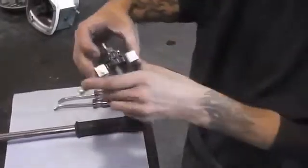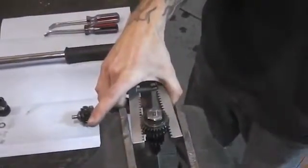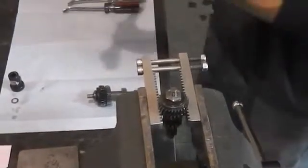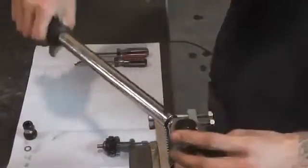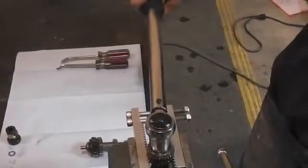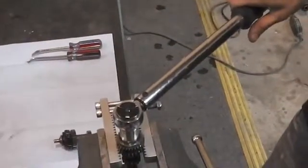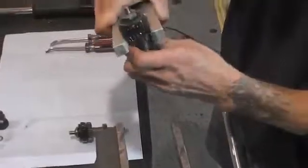We're going to put the clutch right here in this clamp on the second gear down, to make sure you don't hit the other gear on top. Put this in your vise and firmly tighten so it doesn't slip when you're tightening your clutch. Now we'll place our torque wrench on, grabbing just the handle, and tighten until the torque wrench stops. The torque wrench is letting me know that we're at 15 Newton meters. Remove your torque wrench, remove your clamp from the vise, and your clutch.